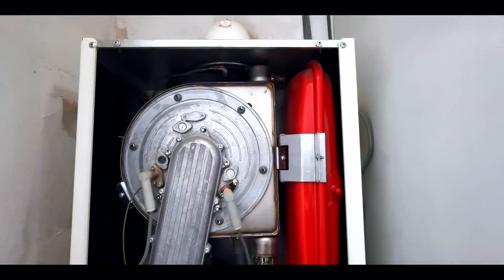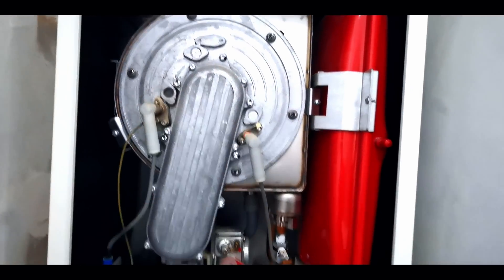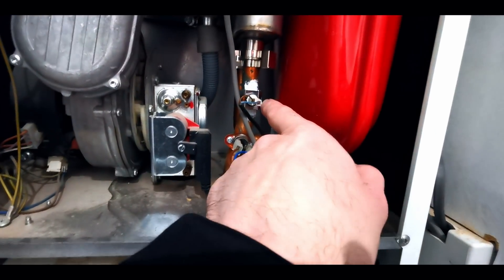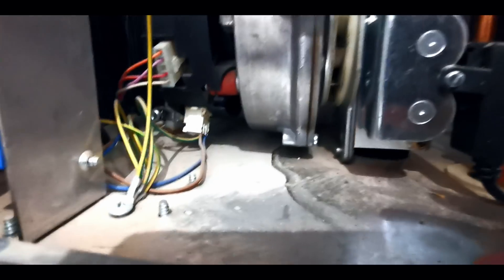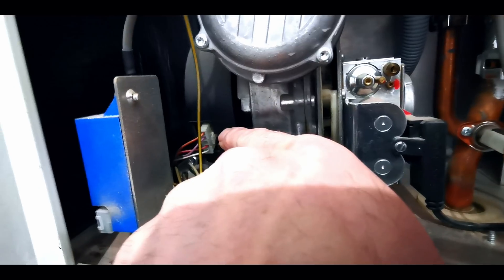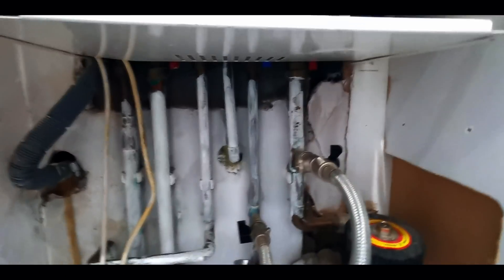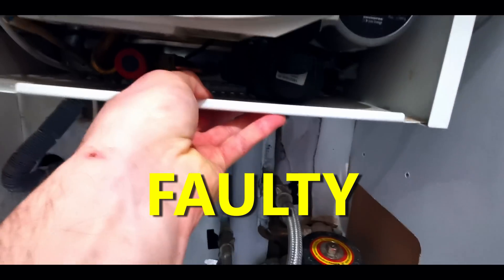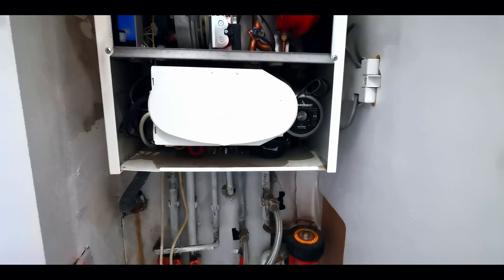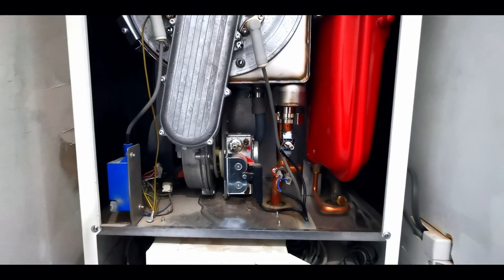Okay, covers off inside it. I do my usual thing of looking at everything. So we've got a flue stat, we've got electrodes - this will be spark, that'll be rectification. We have an NTC, an overheat, gas valve. We have a fan with two plugs on it, so that's going to be 240 and 24 volt - 24 volt there on the control stuff and 240 down there to make it run. Spark generator. Now we have the bits that are probably wrong.